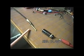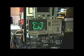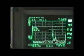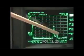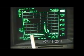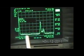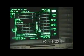So we've got this coil laying here, grounded. We've got this capacitive coupling off of the spectrum analyzer, and we can take a look at this — what you're going to see is this is the FM band, the FM stereo band. And here's the area you want to look at, right in here. You can see noise spikes, and every now and then something that might resemble a very weak signal popping up, but nothing all that exciting.